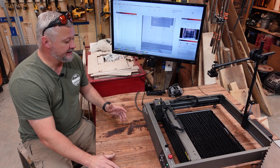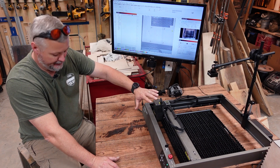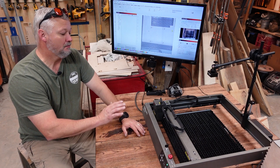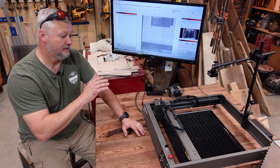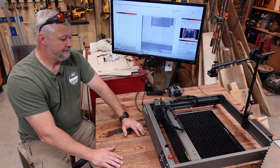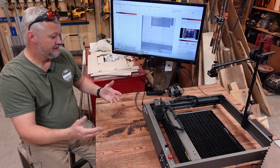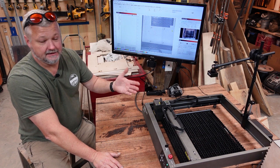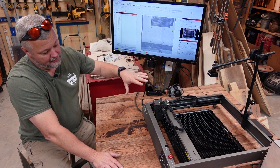So just to hit the high points - you'll notice that this is not what you would traditionally see as far as a honeycomb. It is not shaped anywhere near like a honeycomb. It more closely resembles the cutting surfaces used on plasma cutters and some of the really big commercial lasers that are capable of cutting metal. It's more or less just row after row of what look like shark's teeth that hold the material up. The thing is black, which makes it absorb the laser, cutting down on reflectivity back at your eyes more so than aluminum or steel honeycomb would.